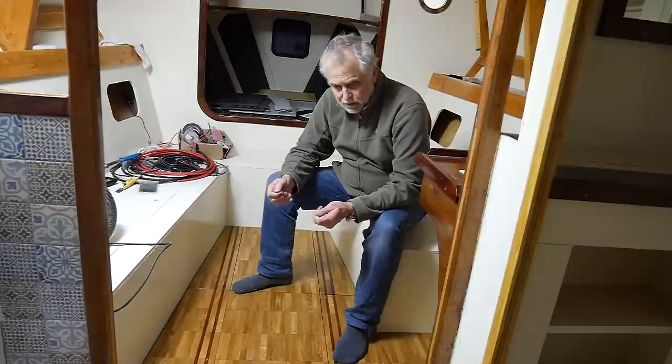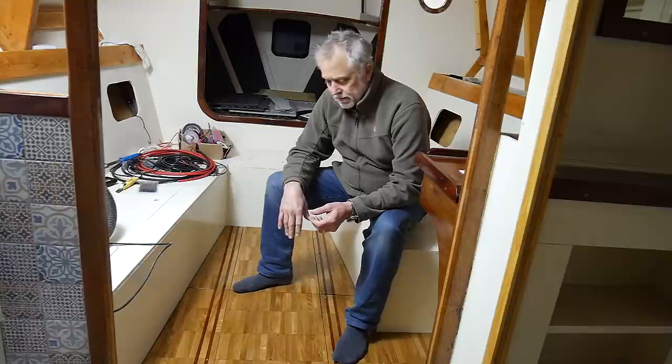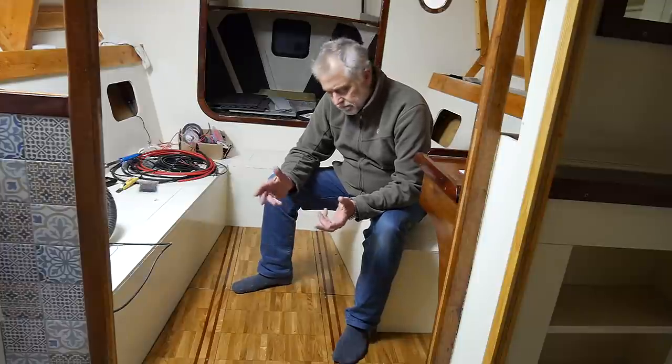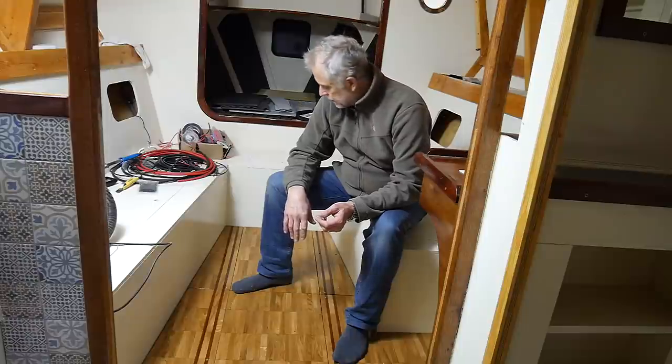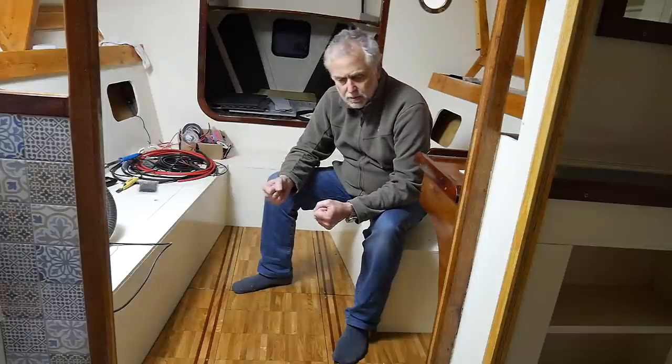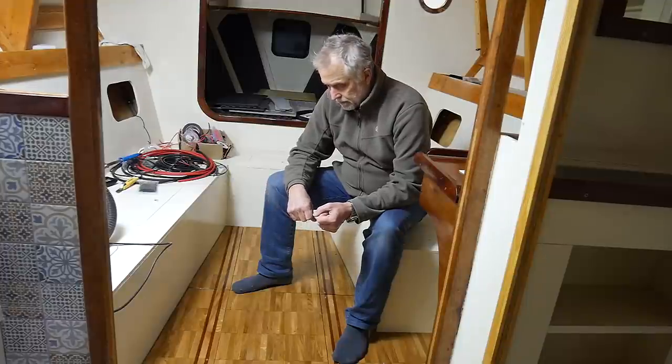It makes for a nice thick board. We've got 12 millimeter ply underboards, and then about 8 millimeters of oak on top of that, a good 8. So the finished board's at least 20 mil thick. Nice thick heavy boards, feel stable, feel solid. Very pleased with that, looking good.